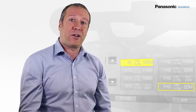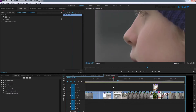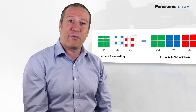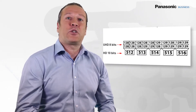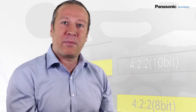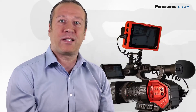4:2:0 8-bit allows keeping the 4K recording data rate acceptable and produces files that are easy to work with in post-production. However, a simple calculation shows that a 4:2:0 4K image has three times more information than a 4:2:2 HD image, and twice more than a 4:4:4 HD image. It is also interesting to note that an 8-bit 4K image contains as many grey shades as a 10-bit HD image. For 4:2:2 10-bit recording, it is absolutely possible to use the HDMI 4:2:2 10-bit output along with an external recorder.